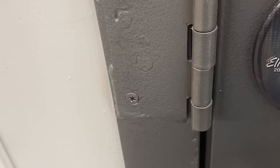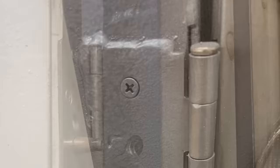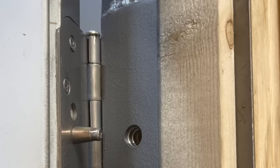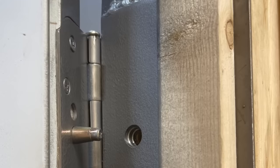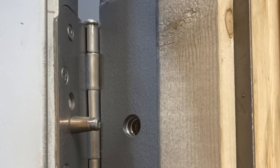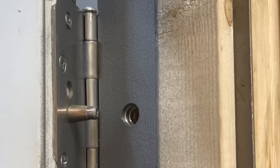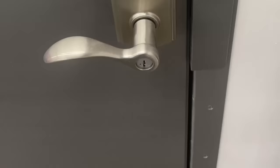As far as the hinges go, I went ahead and welded the hinges directly to the framing. I've only got some screws in there because that's what I used to initially hang the door as a temporary solution — I just left them in there and plug-welded the rest of the holes. I have since gone ahead and tacked the hinge pins in place so there's no way the hinge pins can be removed. I also have these steel hinge catches — when the door gets closed, those catches go into holes of reinforced steel, so even if somebody was able to get the hinge pins out, those pins on the inside of the hinges would not allow them to remove the door. I've got those on all three hinges. I actually found those hinge pins by accident on Amazon and will provide a link in the description below.